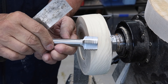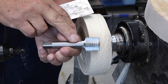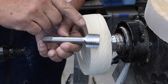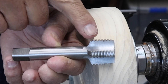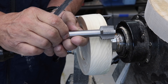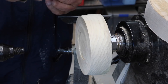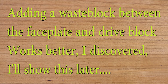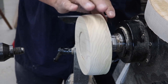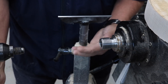I've done a little bit of tapping with a device similar to this before — usually they're much smaller and I've used them in thread-chasing operations. If you look at the profile of this tap there's a little bit of a taper, and you don't really reach the full extent of the threads until you get into this area right here. That means you have to go down fairly deep to reach that point. This is a fairly thick piece of wood, so I'm going to take my block off and measure the threads and how deep they go on my spindle.